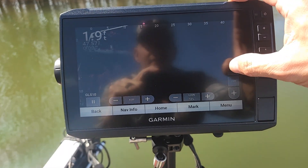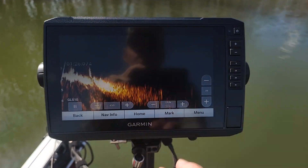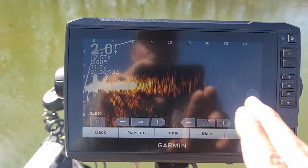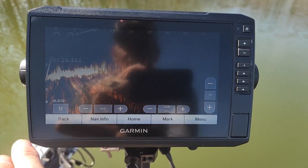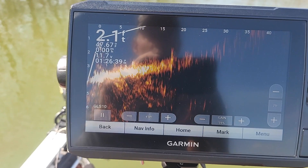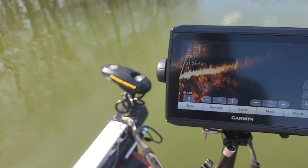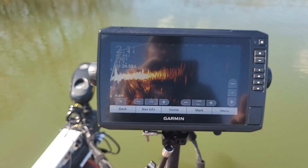On my depth, I try and keep the bottom of the lake as close to the bottom of the screen as possible to maximize the real estate of the screen. Some folks won't ever mess with depth — they'll leave it set on like 20 feet, which helps them better understand how big a fish may be. I'm always adjusting my distance out from the boat. When I'm actually fishing and trying to catch a fish, I like to keep that within about the 20 to 30 foot zone. But when I'm out scouting around, I'll put that out to about 60 feet and turn my transducer left and right as I pan the area looking for fish, cover, or structure.